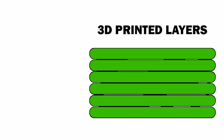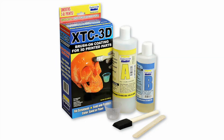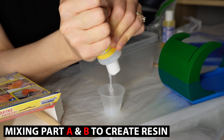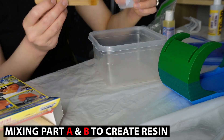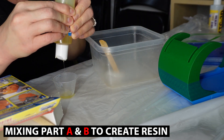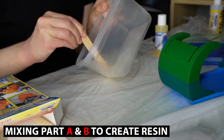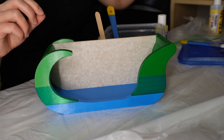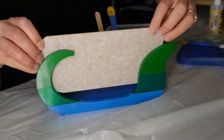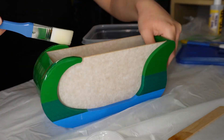The printed model as it was would probably not have been watertight and would have absorbed water and leaked. I think it's because of the microscopic gaps between each printed layer that allow water to seep through. To seal it, I coated it with XTC 3D resin. I slotted in the acrylic pieces while I painted on the coat so they would still be able to fit after the coat dried. I obviously kept the protective stickers on the acrylic pieces while doing this.